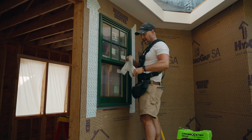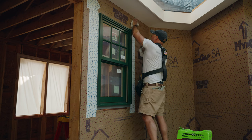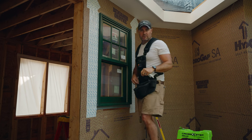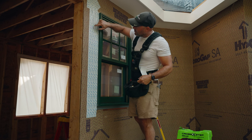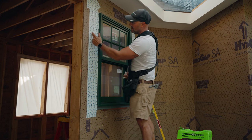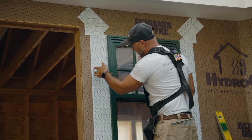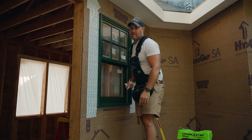There are many different sizes of flashing tape — four, six, eight inch, many different sizes. We choose the six-inch flashing tape because our trim package usually runs about three and a half inches, which is a very standard size. That brings the tape out to about here, and it also gives us coverage where our siding comes in. Where the siding meets the trim is a potential entry point for water, so having that extra layer and extra coverage means that when water gets in there, it just laps down the way it should, stays on the house wrap, and doesn't enter the house.